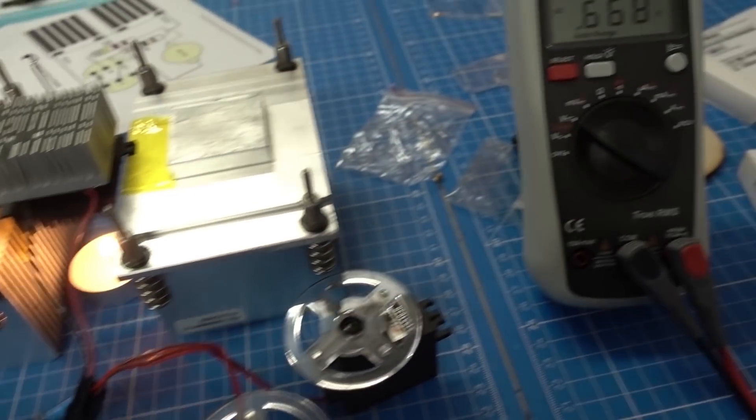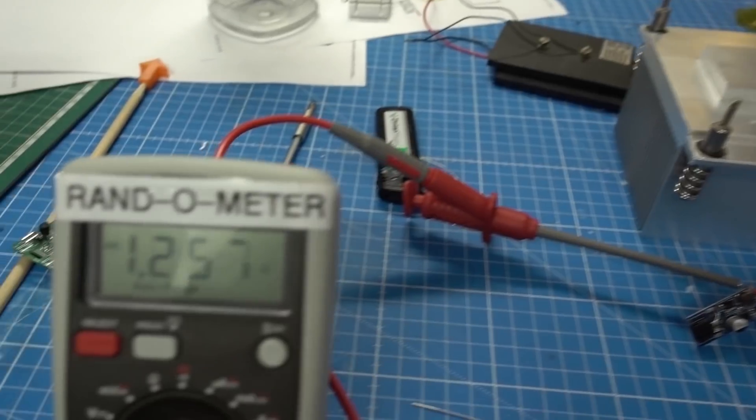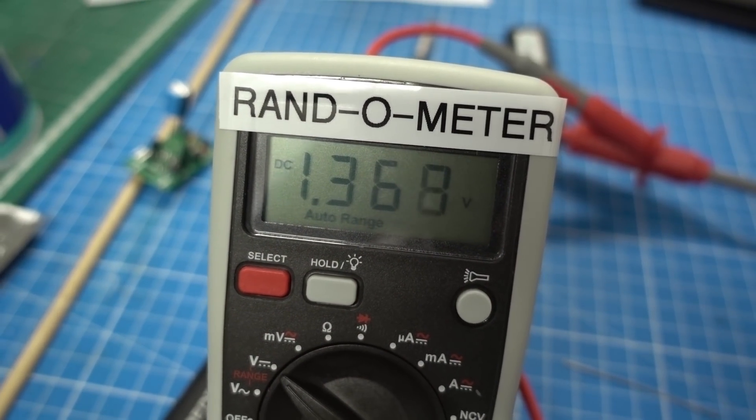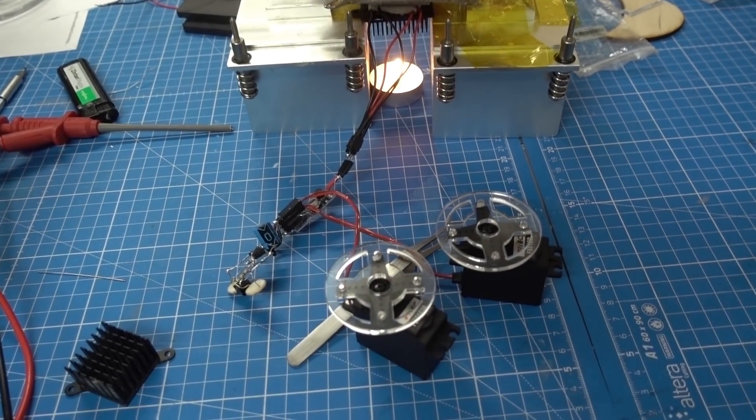I tried out some designs to see if they'd work with a Peltier element too. But after soldering up a lot of circuits and trying them out, I found they kinda work in some situations but not always, and they mostly run out of power too quickly to really perform. Then I thought about these step-up converter modules you can get online for very little money — they step up the voltage of a LiPo cell to 5V to power a USB device. So I tried connecting one to the circuit. As expected, the tiny step-up module works and boosts voltage to 5V, but the LED on the board consumes so much current that there's basically nothing left on the other end. The moment you apply a load, the voltage breaks down.